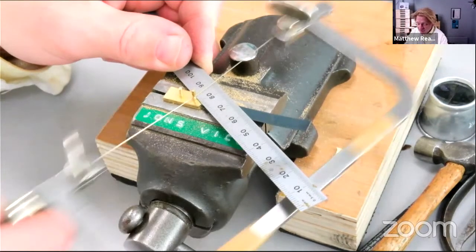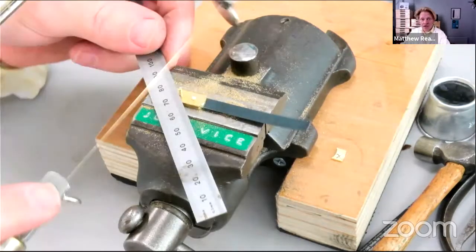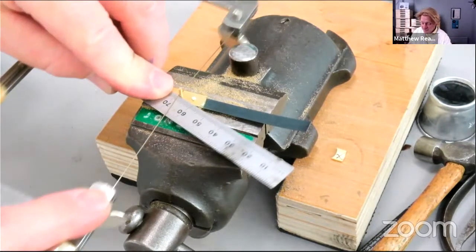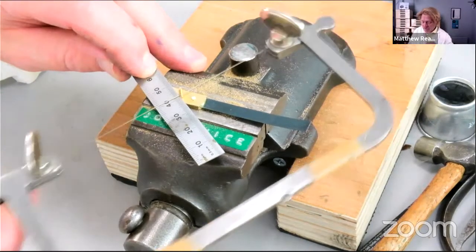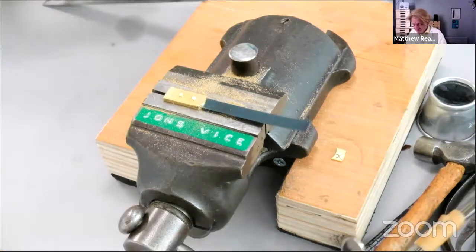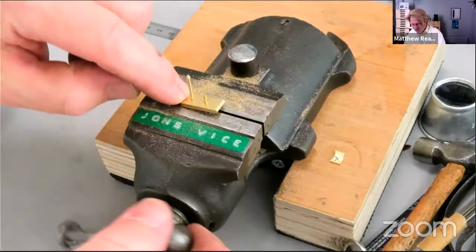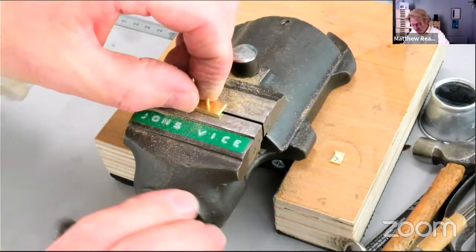When you come to making your first clock, Sam, remember, don't countersink the rivet holes, otherwise you'll never get rid of the marks. Right, every opportunity here to saw through my finger again. Might just have enough rivet left there to hold in the vise. Just about. Try and saw in that direction. It's slightly safer.